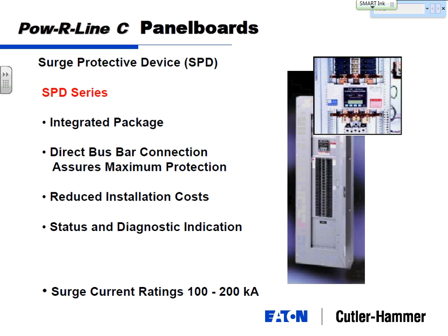So one of the things that people do at home to address that is put on surge strips. Just like what you see here, only you probably have one at your TV at home. The surge strip does a different function as well. Number one, you prevent the voltage transients from going back up the line. And number two, you can get an external voltage transient coming from outside the building into your house. And what's the most common external voltage transient you probably see?